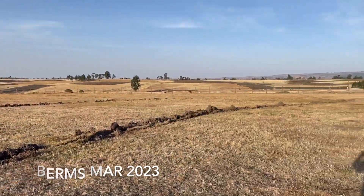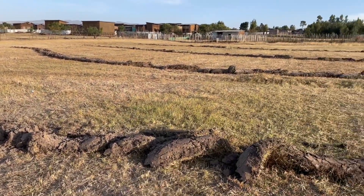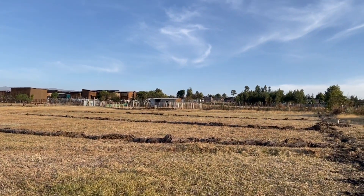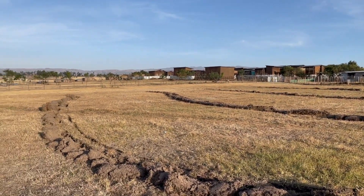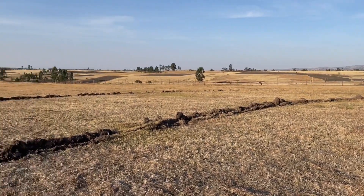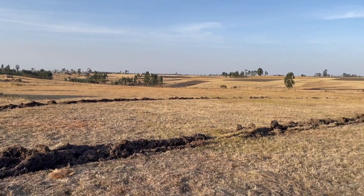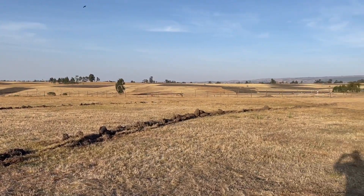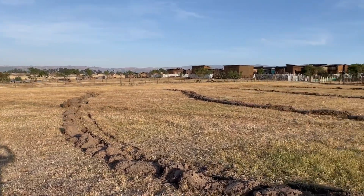As you can see, we spent part of the day cutting in the water retention berms, going all the way up the slope, kind of all cut on grade. They will capture all the water when there's any rain and they'll actually slow the water down so there's no erosion, and they'll actually feed the grass and the trees that will be planted here — it'll multiply everything and grow it a lot faster than if all the water just ran away down the hill.